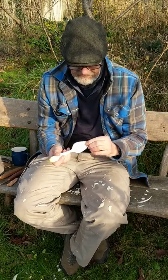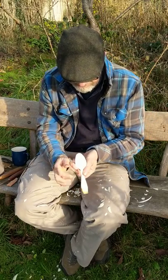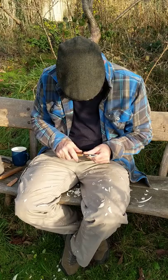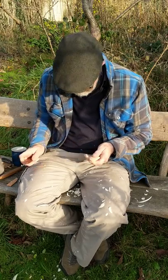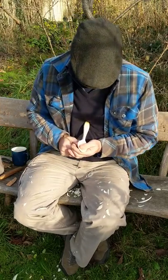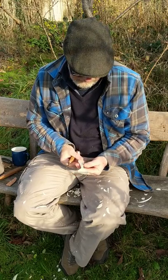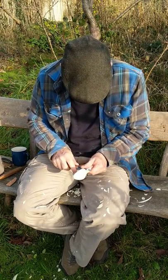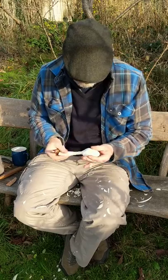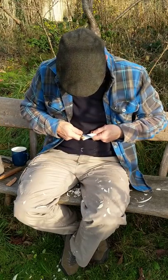You might come back when it's drier and just tweak stuff in the bowl — you'll probably get a cleaner cut. It's a little bit thicker towards the tip. Ideally spoons get slightly thinner towards the front edge — that way they pop out of your mouth really sweet. You might choose to leave it at this point and come back for finishing cuts after a day or so when it's dried, but for the purposes of the video I shall continue. I'm going to strip the bark.